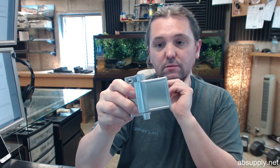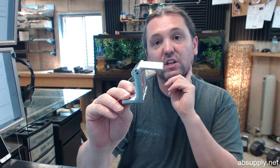There is also a retrofit sticker, SDG-DS, that states 'For your comfort and safety, please use deadbolt.' That sticker is not included with the original packaging. What they are attempting to say is don't count on this being the only vehicle by which your door is being secured — this is just a door guard providing additional security when the room is occupied. The function of this item is to prevent the door from opening, allowing guest or resident privacy when engaged. Disengage to operate the door normally. This cannot be designed to prop the door open, because a closing device on a fire rated door is simply going to push it closed.